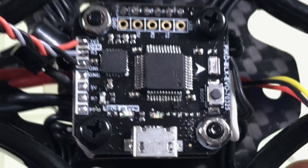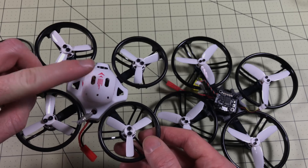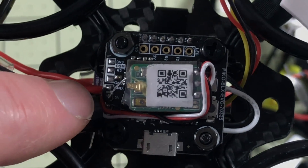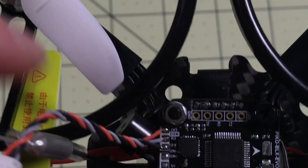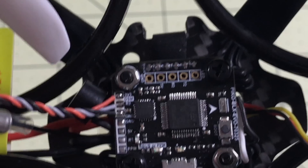What I'm actually going to do is cheat. I have the ET100 that actually came with an XM, so I'm going to open it up and see exactly how they have it wired inside. This one has an XM and you can see it's wired to these bottom three pins. I don't have any DSM2 receivers, so I'm just going to unsolder these three and move them to the bottom so I can use them with my XM.